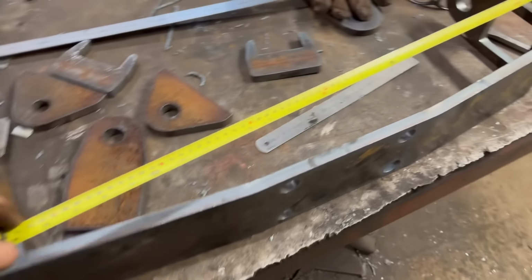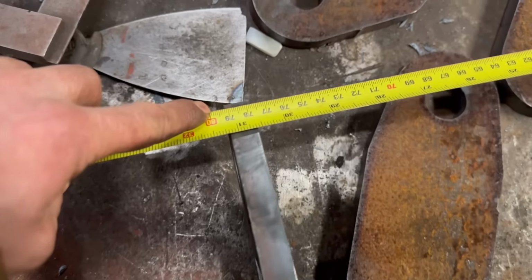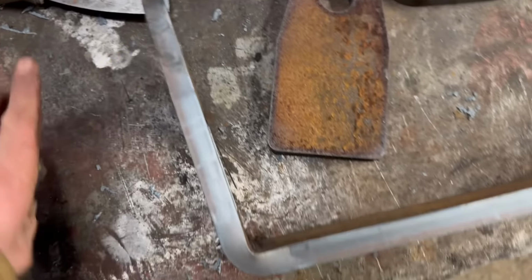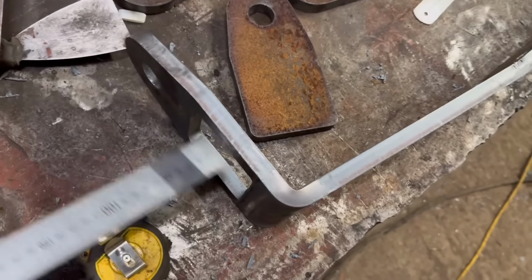So that's that pressed. It measures bang on 800 there, which is what we wanted. It measures at that end, it just measures slightly less. So we have overpressed it a little bit. So I think I might just press these ones back a little bit, because if you put a straight edge through there,